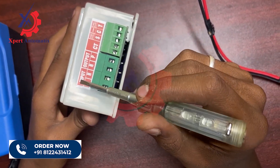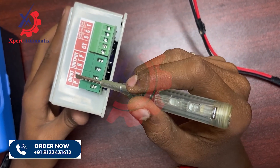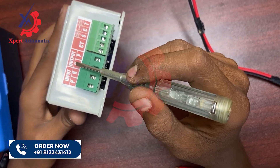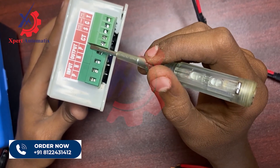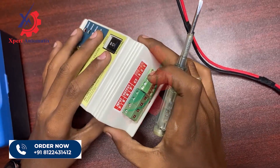In the input you can see the P and N junctions. In the P you have to connect your phase, and N for neutral. Similarly, in the output you have to connect your neutral to N and your phase to P. First let me connect the phase and neutral to my controller.